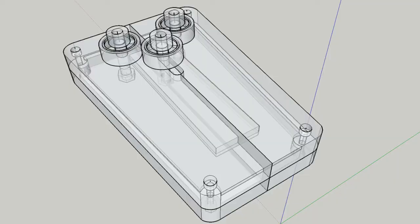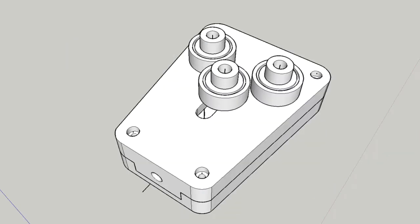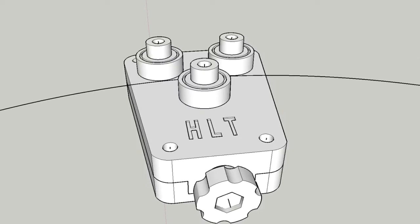With two fixed bearings and a movable bearing in the middle, you can simply adjust the movable bearing to create the proper radius, and then you push the rail through the roller. Don't pull it — you just push it through back and forth a few times until you develop the proper radius that you want.